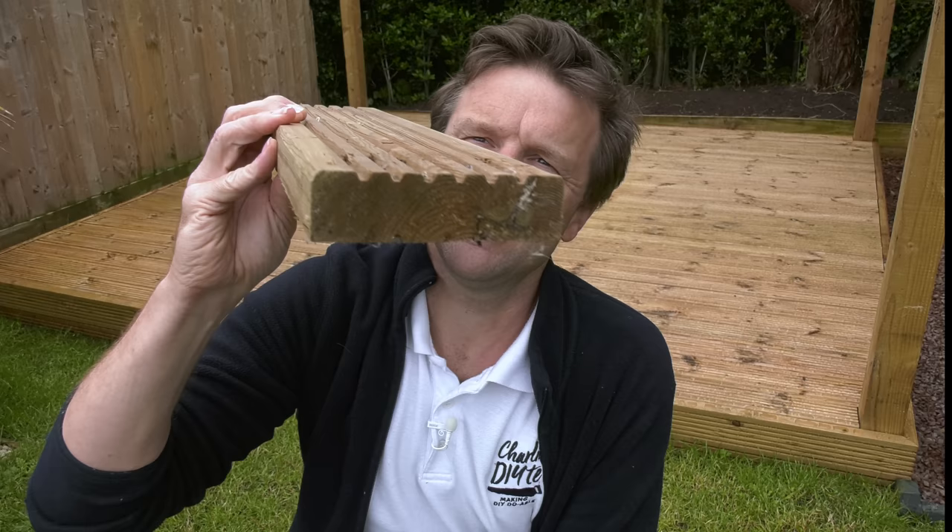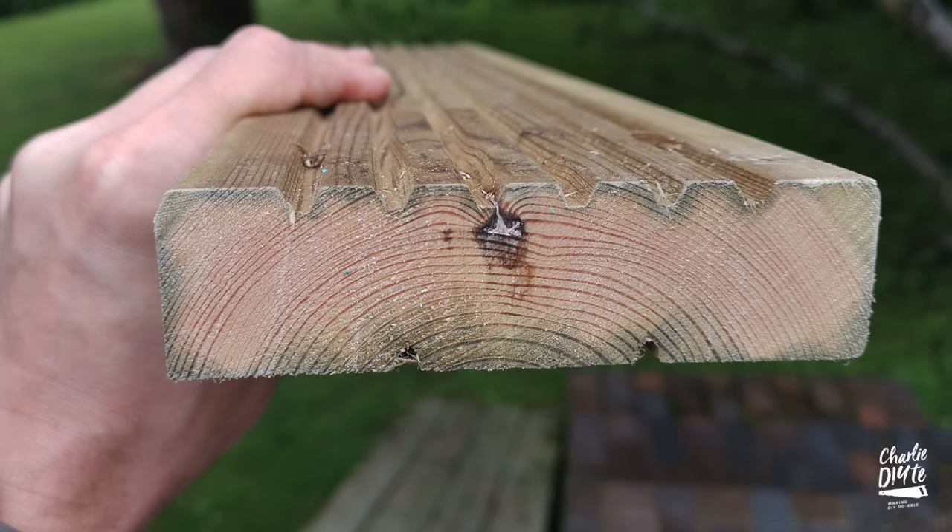You might be wondering why I didn't oil my deck when it was in lovely pristine condition just after installation. Well, I knew it was pre-treated and I wanted to get the hot tub up and running for the kids as soon as possible to make the most of what was left of the summer. But I've since learned it's best to leave a newly laid deck for about six months before you apply any oil to it, as most decks come pre-treated or tanalised, and you want this treatment to erode so that the oil can properly sink into the wood.